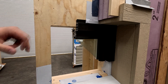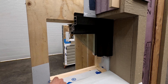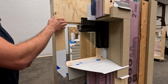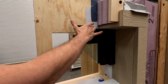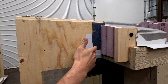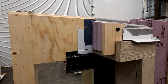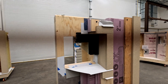With this assembly, the window installation is very similar to a standard construction window install — installed on the framing member at the sheathing layer. We use a sloped sill with shims wherever required for structural requirements from the window manufacturer. Once the window is installed, we tape the window flange and bring the WRB self-adhered membrane down onto that tape, or we can put the WRB membrane directly onto the window flange, maintaining the air control layer through the window installation.